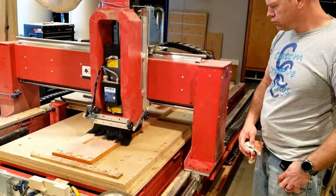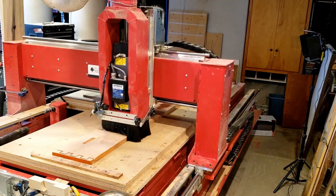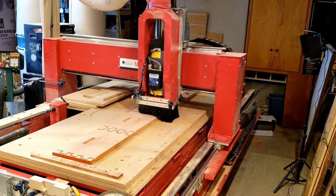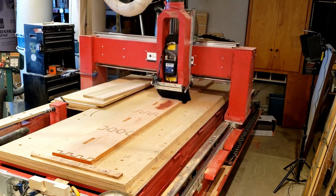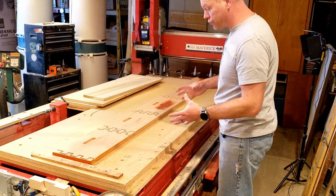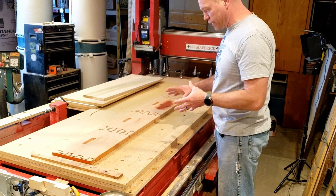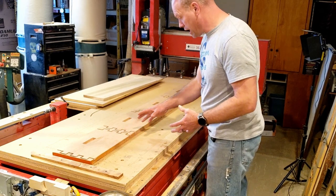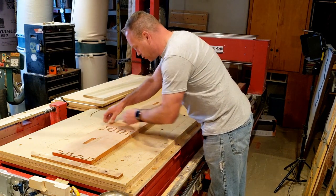I create my handles, then do my cutout. I used a box jig for this in Vectric, so this could be used for any type of box — it doesn't have to be a beehive box. On the three-axis table it puts little dog bones in there where there's a tiny gap, but it's small enough that it's not noticeable. I need to point out a mistake: when I redid the version to fix a mistake from the first version, I forgot to redo my tabs. So instead of tabs in all the smart places it was whatever tabs the program put in, which made things interesting.